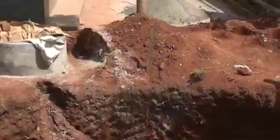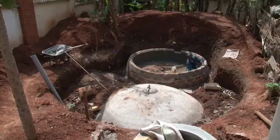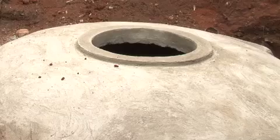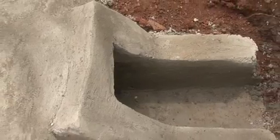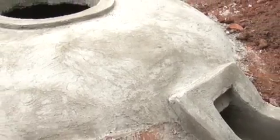Today we are starting the construction of the expansion chamber of the digester, which will also take us to day 7. A complete expansion chamber should normally have a manhole cover to avoid any accident that may result from an uncovered manhole. It is the storage for the gas. And this expansion chamber on the other side has got an outlet canal, which discharges the slurry from the digester.